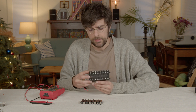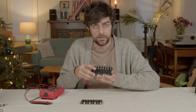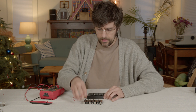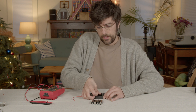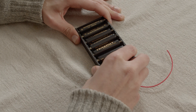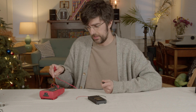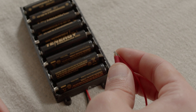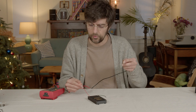Now that we have our battery pack piece in a completed state with all the contacts and lead wires coming out, this is a good time to test that all our connections are good. Take some fresh batteries that have been charged recently and measure them with the multimeter. If they were just charged, you'll probably get something close to 11 volts, which drops down quickly to around 9.6 volts. Set your multimeter to the right voltage measurement, connect the leads, and you should see it at around 11.06 volts — so we're good to move forward.